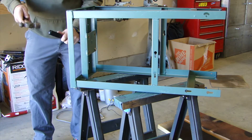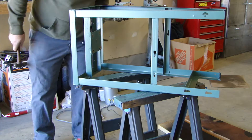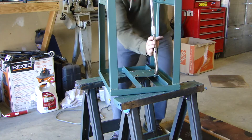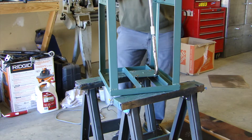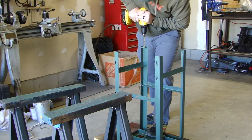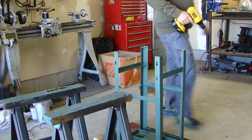This is not working at all. So I ended up getting my slide hammer — it's got a vice grip attachment for it. I put a vice grip on the slide hammer, and then it popped right out. Then I drilled the hole a little bit bigger and it worked just fine.